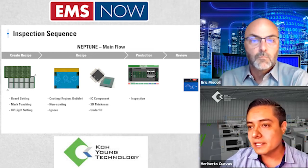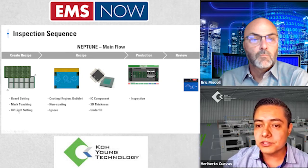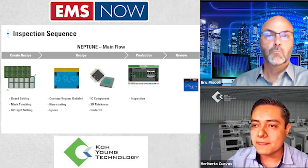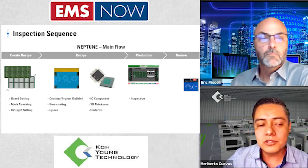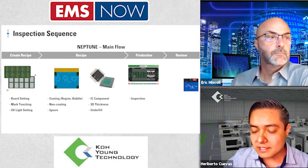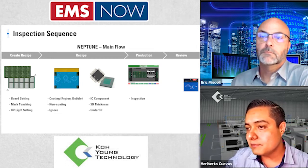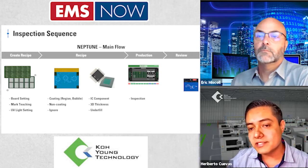Based on the information captured during UV light setting, we can easily set the regions with coating, regions with non-coating, and ignored areas. For example, board corners with holes we don't need to inspect — the tool finds these automatically and ignores them. We also have a standard library for IC components that creates a database relating each part number to a specific package. For future job files, this information is already stored in the database, pulled out to the new recipe with only minimal fine-tuning needed with more samples.